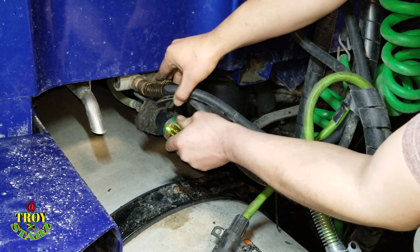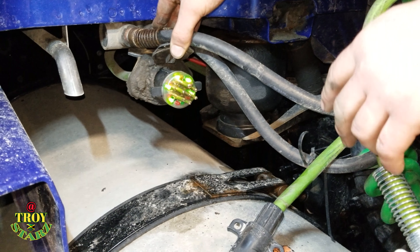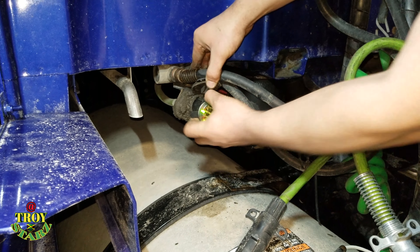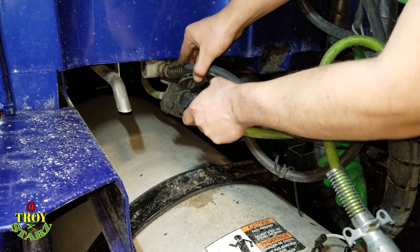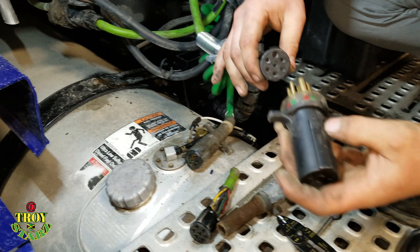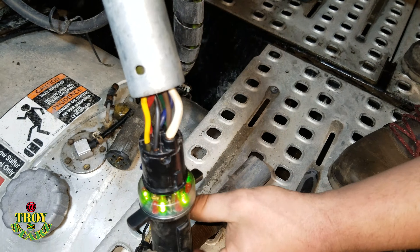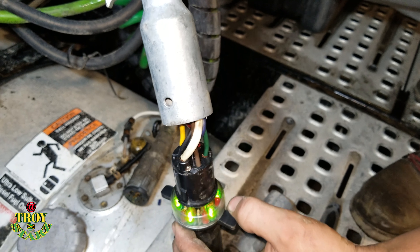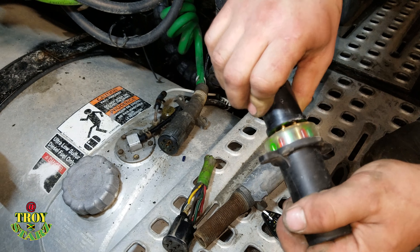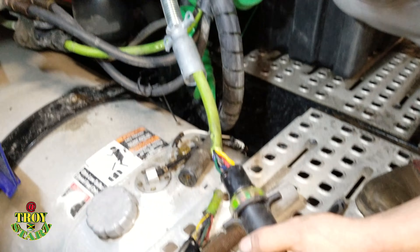Get this one ready for action again. The nice thing about this double-ended tool is that it works both ways. So you plug it in and you can see it working. The only thing we don't have working right now is the stop light because no one's pressing on the brake. So at least right now we know coming out of the back of the truck we're good. We'll take that out and plug in the cord that we're going to use. Make sure it locks in good, and before we close up the cord that we just repaired, we're going to come in and you can see everything's good — auxiliary clearance, right turn, left turn.